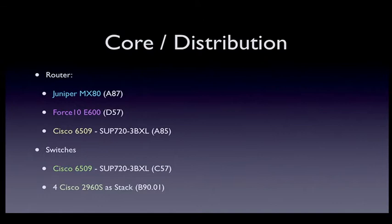Coming in from the network, we had an MX80 with 20 gig going out each direction, basically out to the internet, as it were, and into the middle of the network. Force10 E600, so similar to camp, and we had some Cisco 6509s. One routing and one as a switch, for our requirement for lots of 1 gig E copper